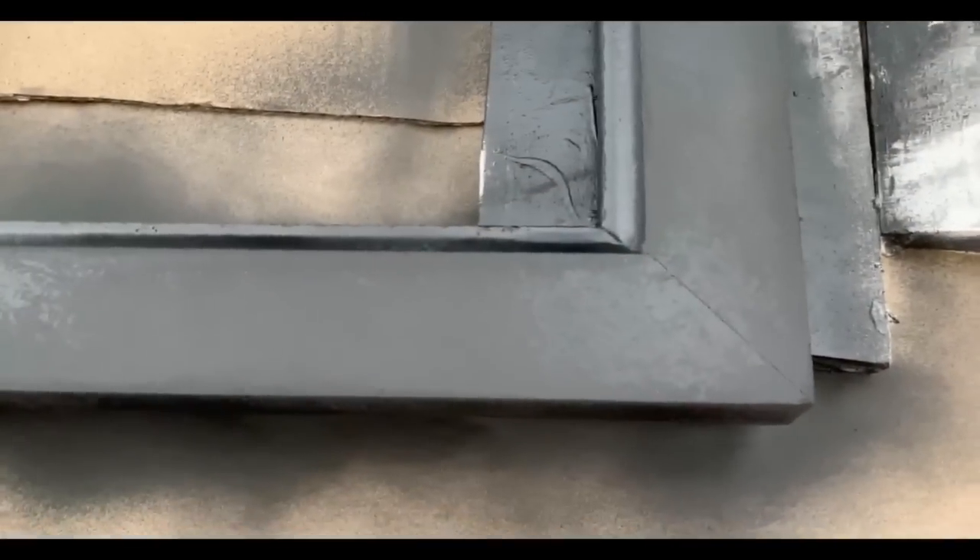Now I'm on to spraying polycrylic after my black has gotten two coats front and back. What the polycrylic does is seal that black spray paint in and give it a nice base, so when I go to distress it and put the wax on, it doesn't go chalky. The spray paint kind of likes to blend in with the wax, but if I seal it in with polycrylic, it works just fine. And polycrylic in the spray can goes a long way.